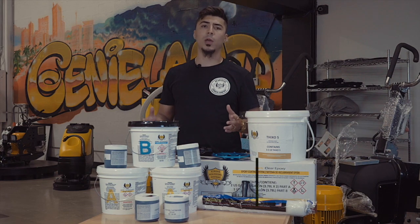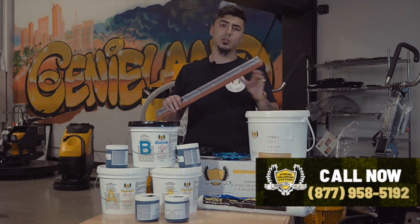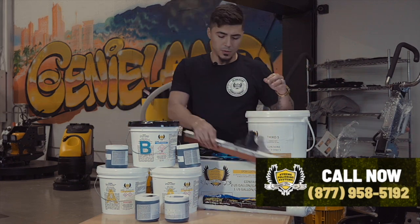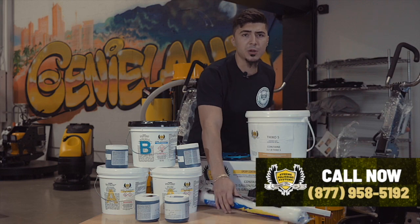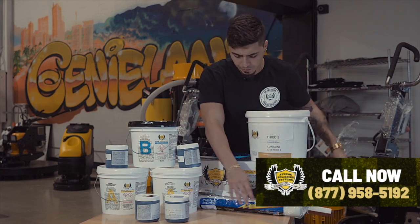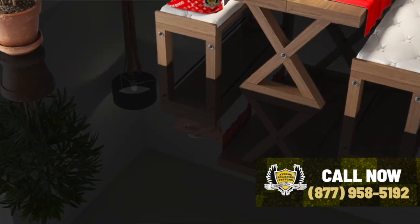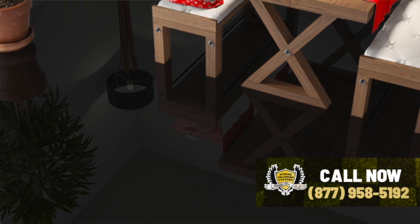You're gonna lay down the whole kit. You're gonna squeegee it just like the first coat. Move it around with the squeegee, then you're gonna follow that with a back roll with your napped roller. Let that dry for 12 hours and you got a solid black floor. Beautiful.